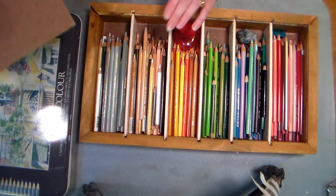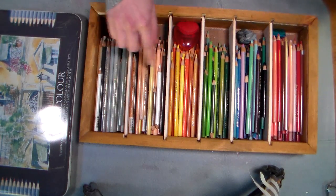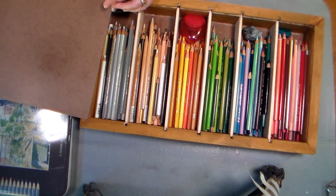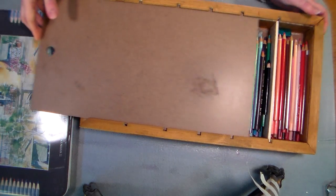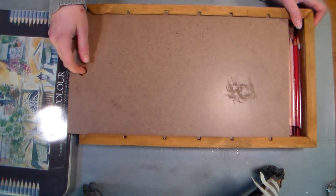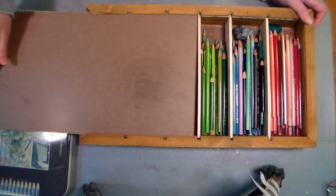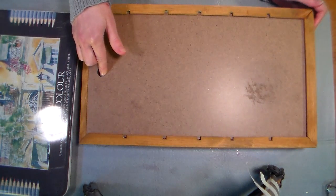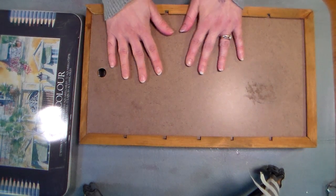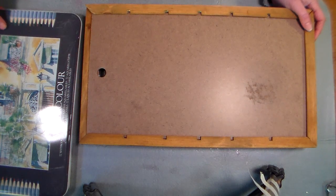This is made with pine, and the top and bottom are masonite, and these little strips inside are just some thin plywood. It's a project you could definitely make yourself — the woodworking skills you need are basically using a dado blade on your table saw, making rabbets and dados. I just love how easy it is to slide this open and closed. My big worry was that it was gonna stick, but I'm so excited that I've got this box to perfectly hold my pencils.